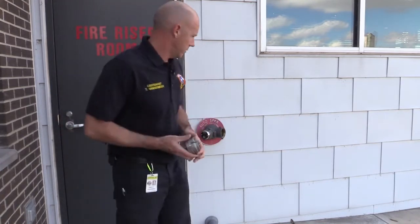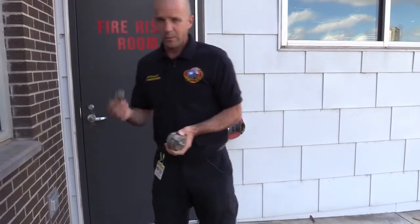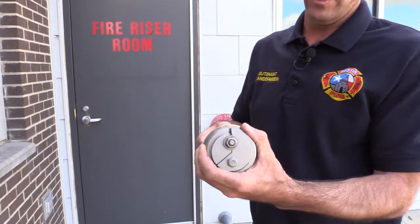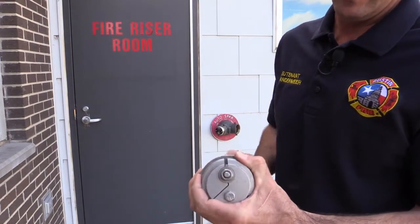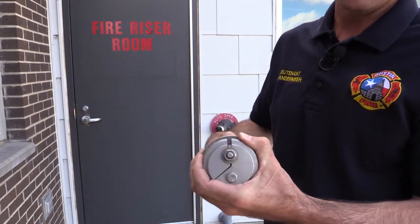These are simply a plug — they screw in and then they screw back out. The difference is what they've done to make them lock. We have our FDC key and we put that into the keyhole, and as we tighten this down — going to the right — the threads start to spread out and they cam into the hole, locking it into place.